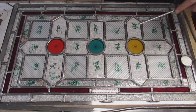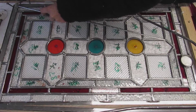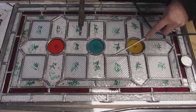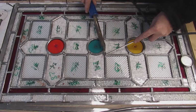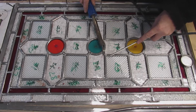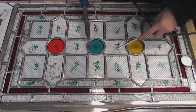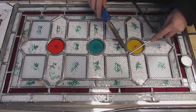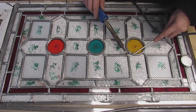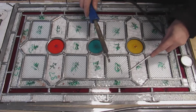So it's always a little bit hot when you start, so I tend to start on the slightly thicker lead at the corner. So there, just a little dot. Solder is much stronger than lead. You don't paint, you use it flat and you leave it on the joint. The joint needs to heat up and then the solder will run onto it. So the angle is very flat. Now I'm just starting on these joints for no reason other than they're in the middle of the image you're looking at.